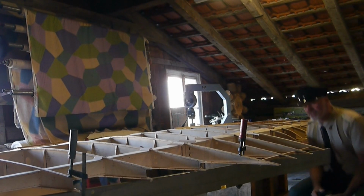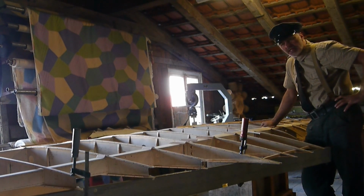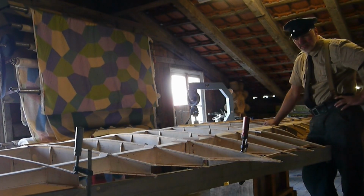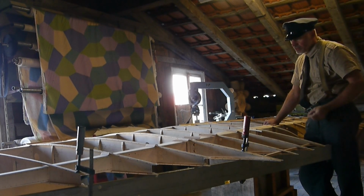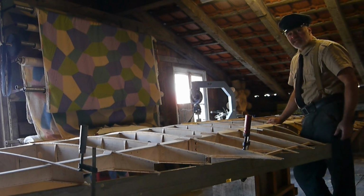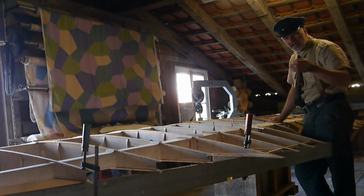It was a rather interesting discussion I had yesterday in the evening with Morten. How do I do it now? We talked about what some people think, how immensely complicated the building of an airplane is, just because everything has to fit so perfectly well. We talked, for instance, of metal parts when they were turned or created on the lathe or forged or filed, fit so precisely. And eventually, when they get painted, another 2/10 of a millimeter of paint sit on top of them, the pieces don't fit together anymore. The parts then can't be either assembled, nor do they move any longer. There have to be certain gaps and tolerances in those parts, otherwise you can't assemble them.